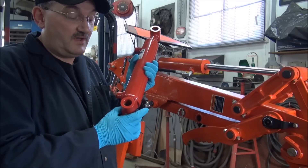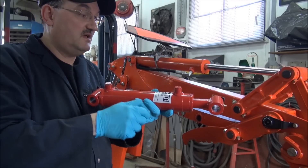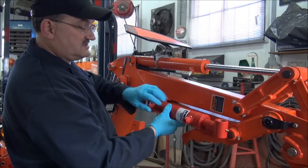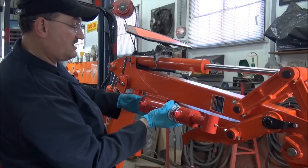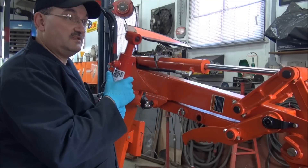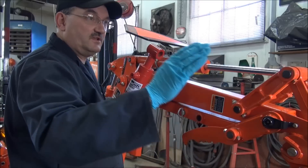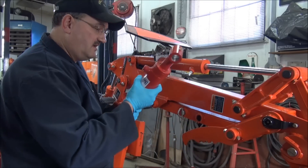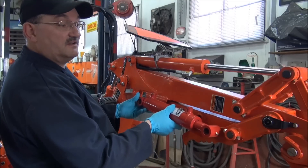I needed to do this anyway because the orientation of this cylinder is wrong. My inlets are on top of the cylinder, and it really needs to be oriented so that I can gain access to my hoses. So I'm basically just going to turn this one and when I weld it back on it's going to be the opposite direction. That'll give me my three inches, which will be 19 inches closed, and I'll have roughly around 27 to 27.5 inches fully extended. This one is running around 28 to 29, so it should work out okay and be a nice little mod.